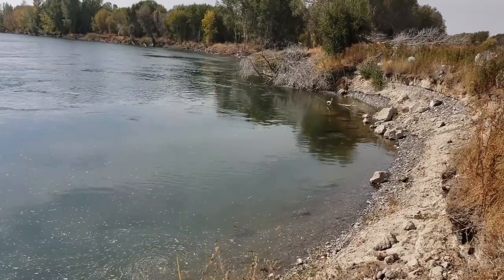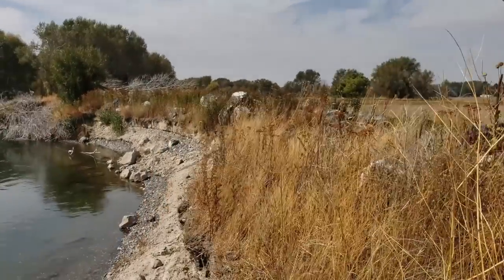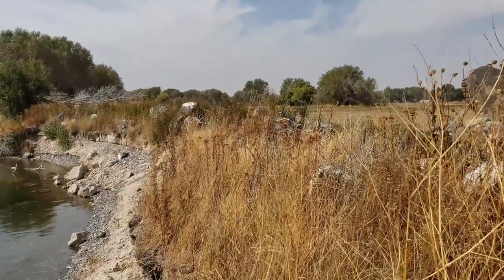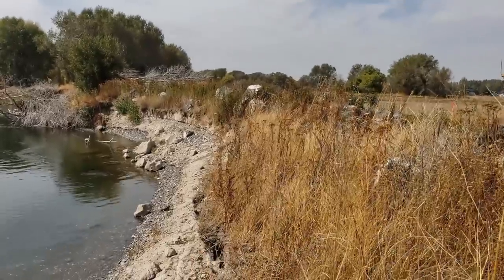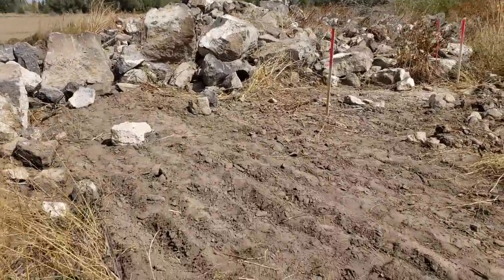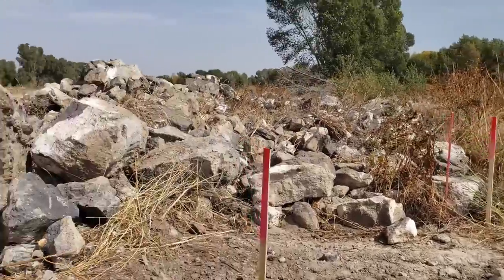Right there where I was standing they put some riprap in and it's holding it, but this out here is really caving off — good fishing hole, there's been lots of fish jumping out there. You can see it tore off the riprap they had here. The other thing you can do — and then you don't need a permit — is stack all your rock right along the bank and then as the river comes along it falls in, but the problem is it's going to fall off a little at a time. The other way is to dig a big trench, put all your rock down deep, and then as it eats the bank off it comes up to the rock and stops because your rock is deep. But the problem with that is you've got to dig a big trench, so you're going to have quite a bit of money into moving all this material.